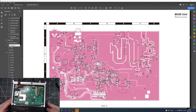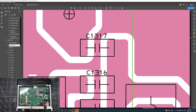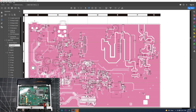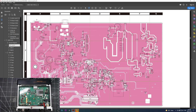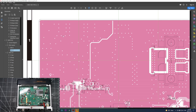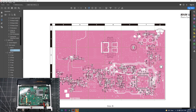Let's take a look at the schematic here. C1317, C1316 — these two are charred up, and C1315 is non-existent on my board. So I'm going to try replacing those without removing the board, just for the heck of it. I'm curious what's on the other side of the board — nothing. Okay, the finals are right here in the middle. Let's find the parts list.